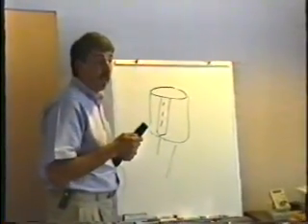Can you see it on your little capacitor? I'll show you another one up close here. This is the minus side here. That's the negative side. The positive side is not marked, but there's the negative side. You'll also notice that the positive lead is the longer of the two — one lead is longer than the other, and the positive lead is the longer of the two.